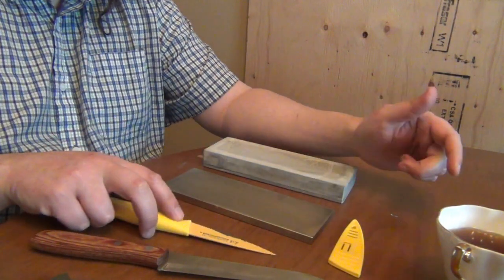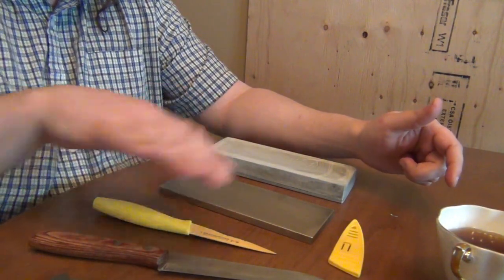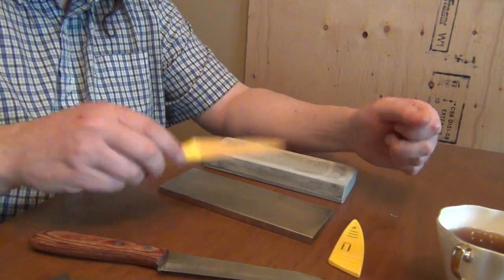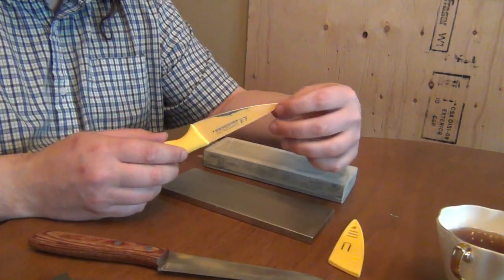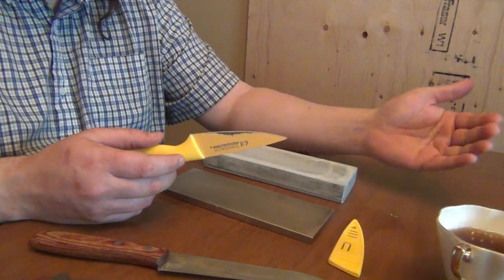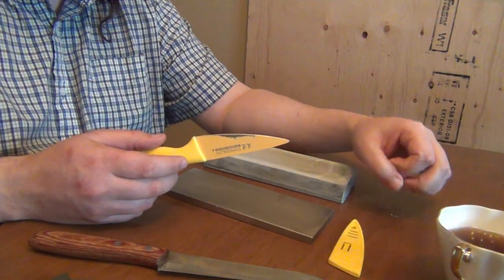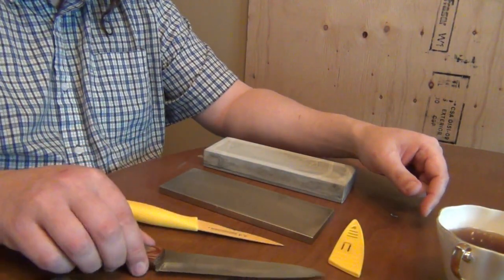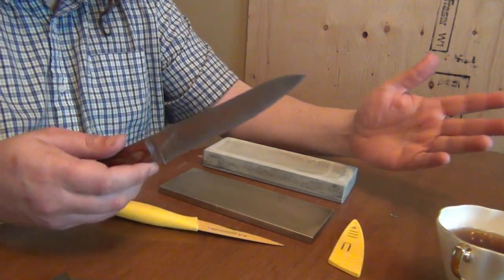So I did everything 3 times. Cut the apex off, resharpened it, did the whole thing, and did it again 3 times with each knife. And the second and third times the performance was much better. No big chipping, slight microfracture of the edge, which I would expect, but nothing significant. Just mainly stayed a little bit into the edge bevel. It was mainly into the apex bevel. The Spyderco utility, of course, just wore smooth. That's what you would expect.